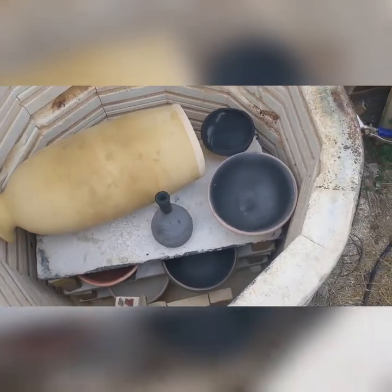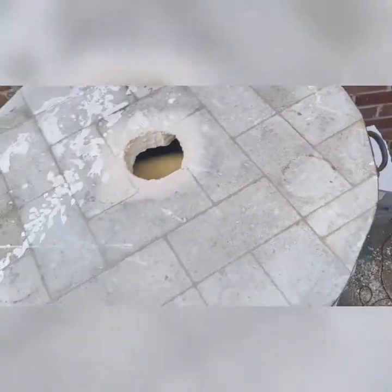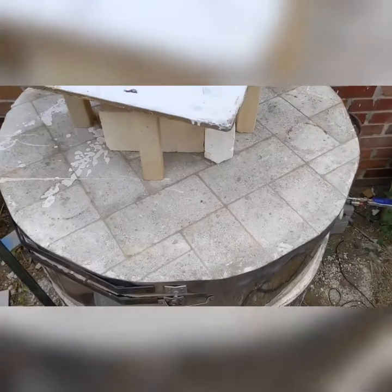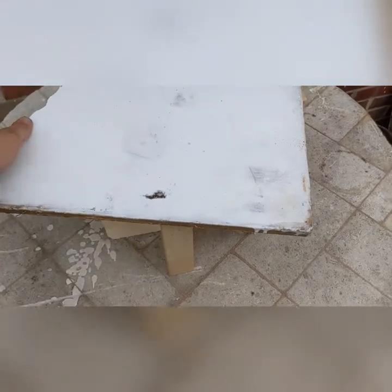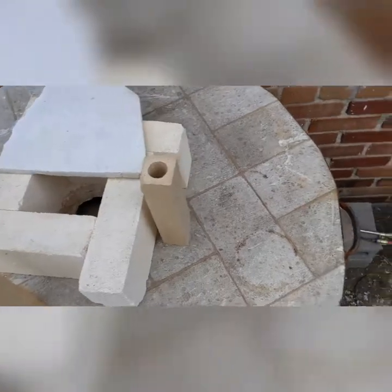It's easily visible from the peephole. It's starting to rain here, so I'm going to close the lid on the kiln and candle for maybe about a half hour or an hour and we'll get going. Alright, so it's been about 45 minutes since I started the firing. I've got this kiln shelf on top here because it was raining, so I'm going to take that off. Holding my hand over the flue, the kiln is probably at about 200 degrees right now.